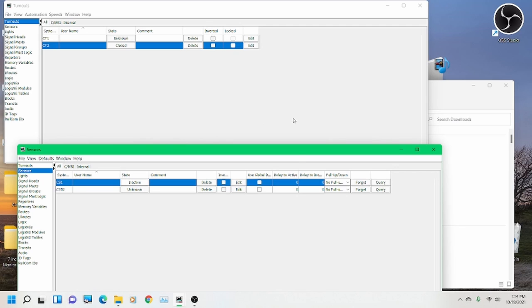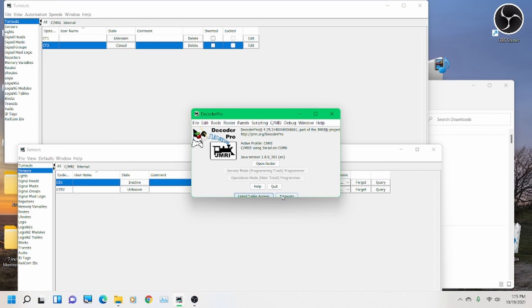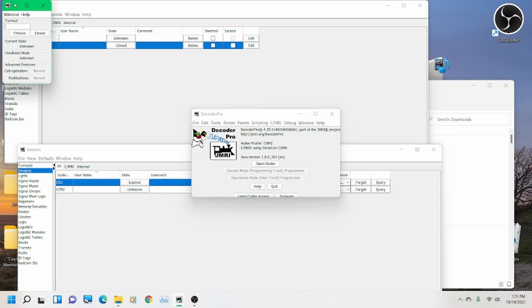Okay? The other thing we talked about was the button that we added on here for turnouts. This is internal to JMRI, but if you had a LocoNet system of some sort hooked up here, it would work equally as well. You can just come over to address 001 on the turnout and do a thrown and watch it change. Now, it's changed because of the definition there. Both of them did. But change it to closed and they'll both go back. I've got them linked together. That's how it works. Just simply, you know, with your throttle, you would do a closed and a thrown.